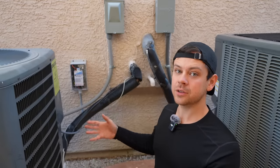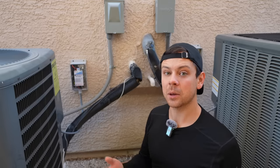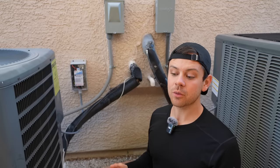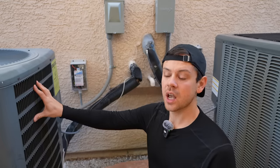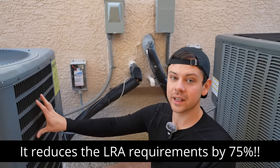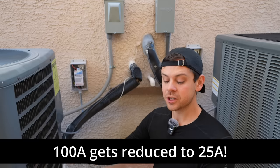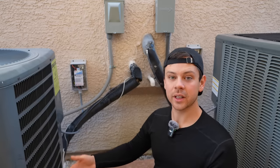If you're trying to run your entire house's panel off of an off-grid solar power system, or you have a complete home backup battery like a Tesla Powerwall or an EP Cube, and you are using a transformer-less inverter circuit — which a lot of them today are — it is highly recommended to install soft starters on any traditional air conditioners. This reduces the startup current required to start the compressor's motor in the condenser unit, so instead of needing 100 amps to start, it can start with only 25 to 30 amps, reducing stress on the circuit and in theory increasing its longevity.